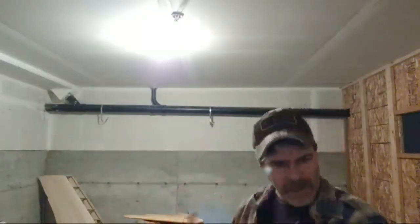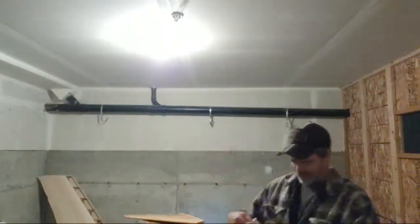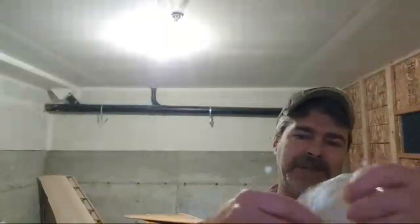And a lot of you called me and asked me, what about a thicker cloth? No, 1 ounce, more than enough. 1 ounce cloth is, this is a used piece that I cut off my spoilage. But if you look, guys, this stuff is tough. And once you put it in, 1 ounce is all you need. You don't need any more. You don't need to double laminate it. You don't need to do it.